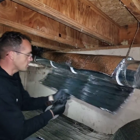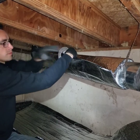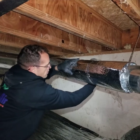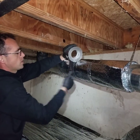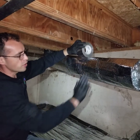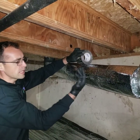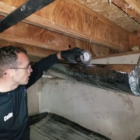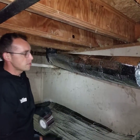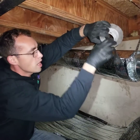I like to do it this way because the next piece of tape I put right here in the middle, then go all the way around. It's important to do it on top of your spacer so you have some backing — otherwise if you collapse this right onto the pipe you're basically wasting that spacer and not getting that desired R8 value. I overlap the tape as well, and then do the same on this end, on top of that spacer.